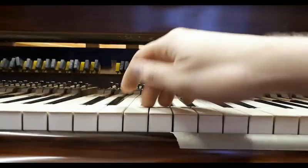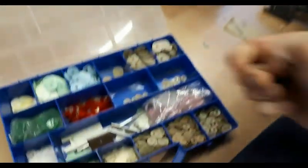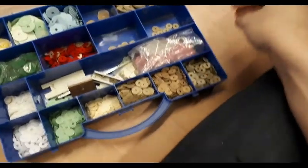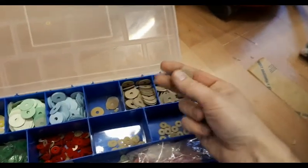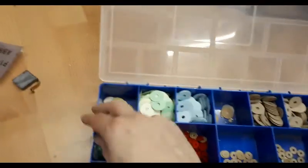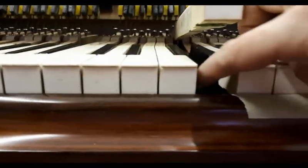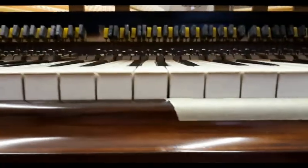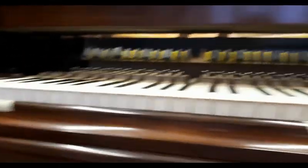The way we set these: lift it up, take this out from the front — you remember the paper weights and everything I took out? The newspaper clippings from 1903 — well, these are the modern day equivalents. We've got stuff that's that thick all the way down to the wafer thin ones. Same as the old thing, you just pick what you want, put it underneath, put that back on top, push that down, and then test it with the gauge to see if you've got it about right.